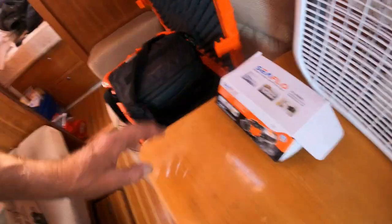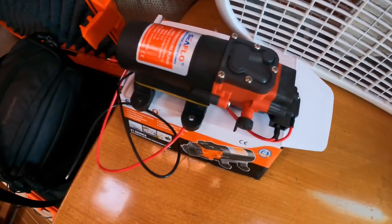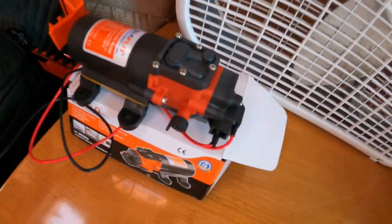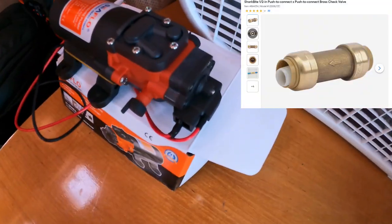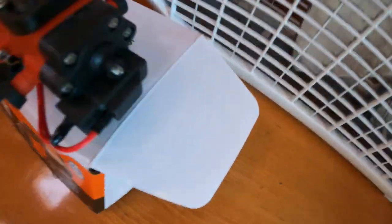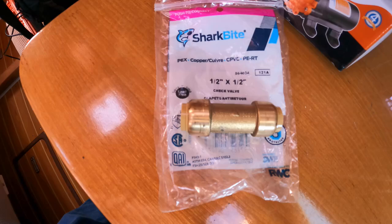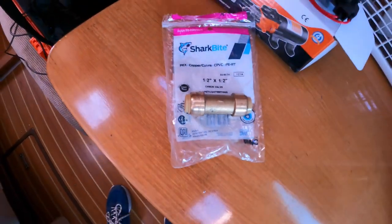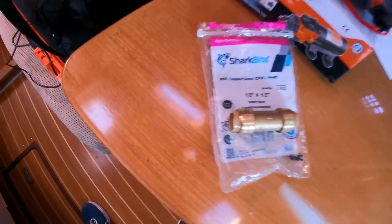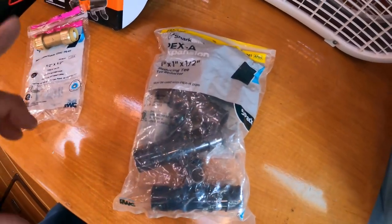Here's what I came up with. I got a pump — a little pump that's about $20 to $24 on Amazon. It's a Series 21 Sea Flow with 3/8-inch inlets and outlets. I also went to Lowe's and picked up a check valve — it's got pretty low pressure to open, but the pump should have enough pressure. The pump moves about 1.3 gallons per minute. I also got some hose and I'm thinking about teeing it into the bilge using the check valve so it doesn't back-flow.